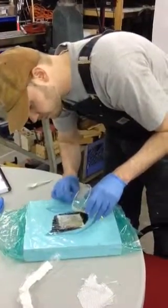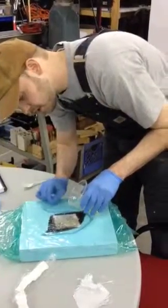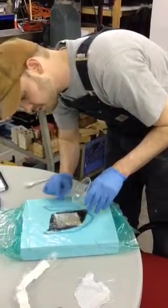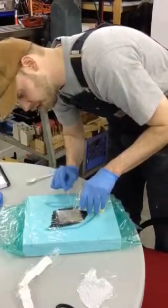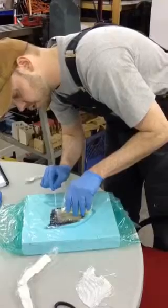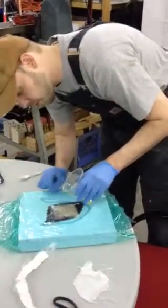Doesn't matter if you put on too much? No. Well, okay, it does matter, but not to our detriment. What it does is it makes the final part heavier. But if we don't wet it out, it's a void spot that's just as soft as cloth. So that's actually a terrible thing. So I err on the side of over-wetting it.